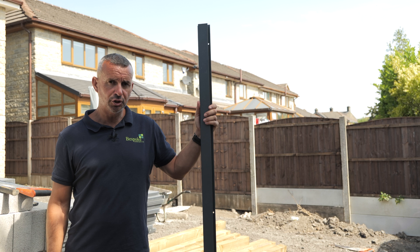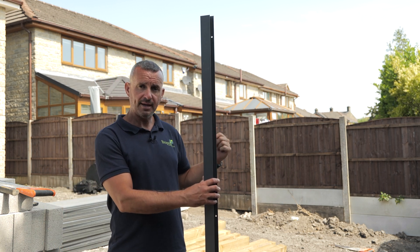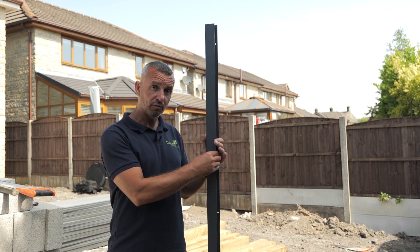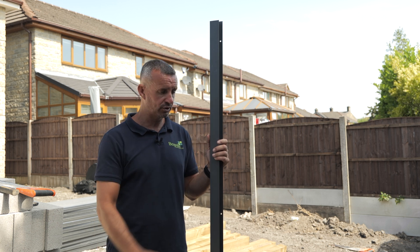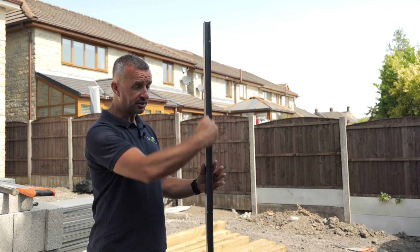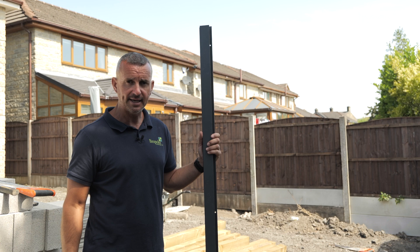What I've got here is what we call an internal — this will fit on the fence behind us. That again is a party wall but it's the responsibility of my customer. This will fit straight onto the concrete post; we've got a nice straight line on the post. We've piloted the holes, rawl plug and screw — that will fit onto the existing concrete post, and then your internal panels will slot either side. It really is that easy.